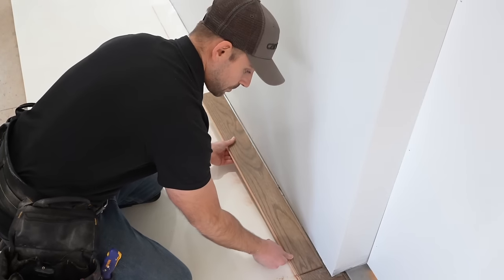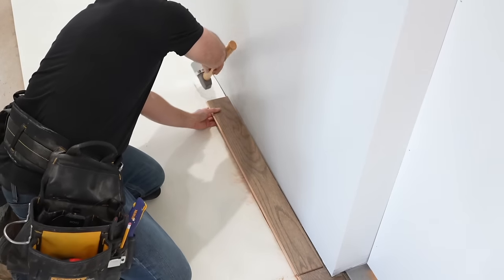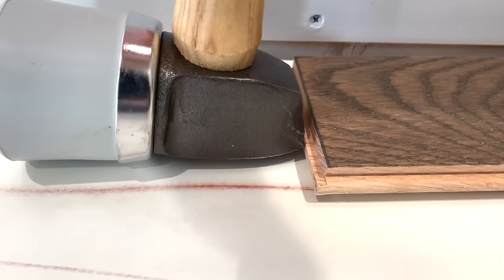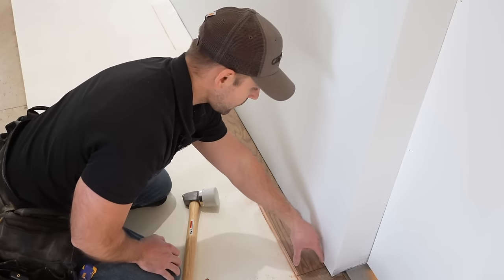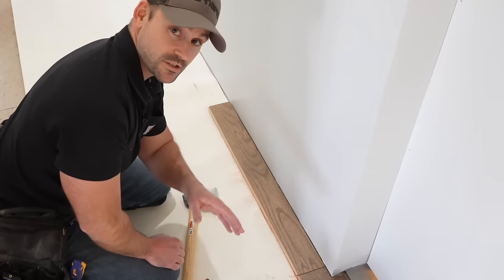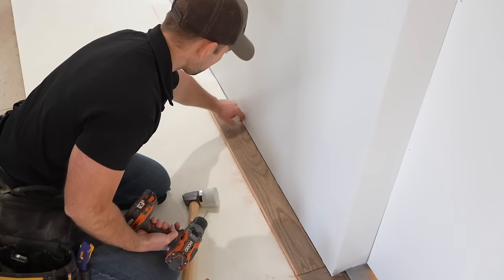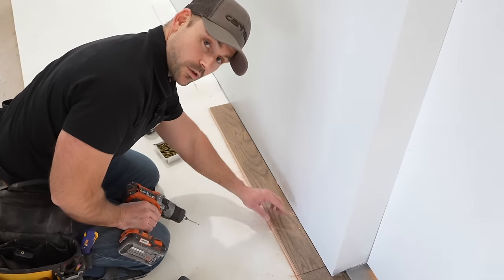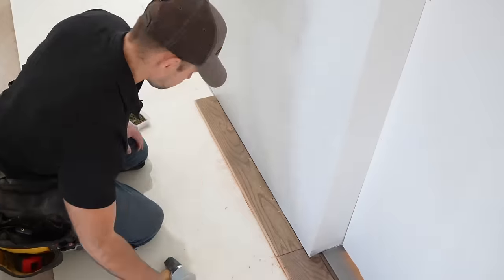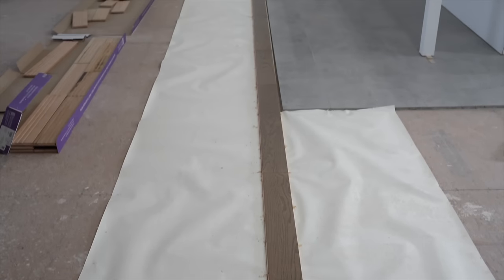Now that the flooring is ripped down to size, we place it together just like we did all the other pieces, except anchoring it is a little different. Never use the flooring hammer to butt pieces together — use the pointy end where it slides under the tongue so it doesn't damage the hardwood floor. To secure this piece, face screw about every six to eight inches across the back and then place some across the tongue. When putting in screws, don't go further than a half inch so the baseboard can cover them up. Don't be afraid if you hit the wall a little at the bottom — the base will cover it.